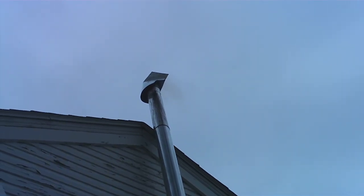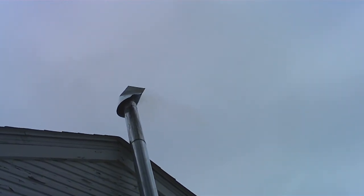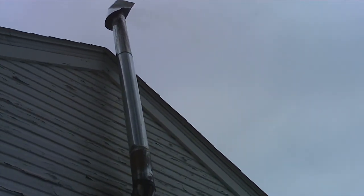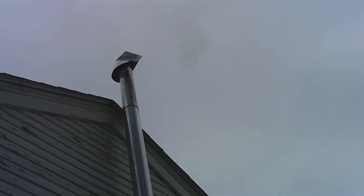The wood's probably just starting to ignite a little bit. Going back outside, there's probably just a very little bit of smoke, but mostly steam — it'll get about a foot or two away from the chimney and just totally disappear. If it was actual wood smoke, it would obviously leave more of a trail. I've checked the temperatures several times: it runs about 800 to 1,000 degrees here and anywhere from 600 to 800 degrees off the top, and the stove pipe itself normally runs right around 80 to 100 degrees.